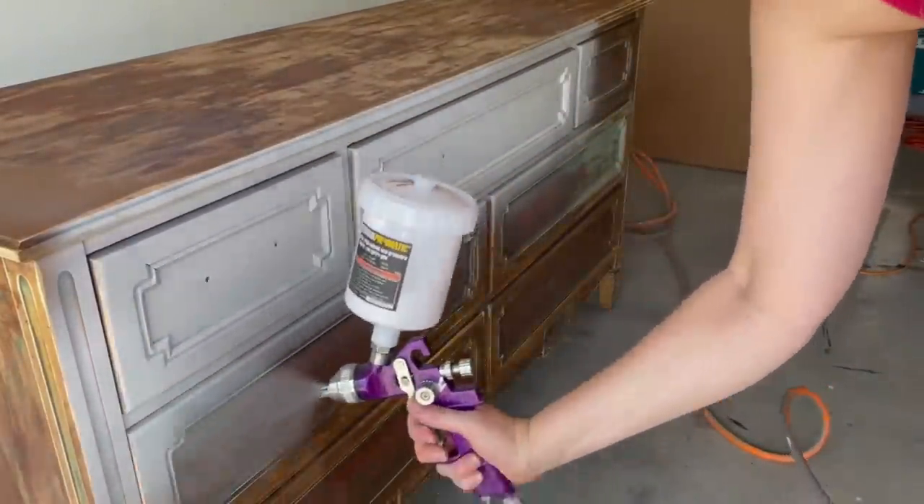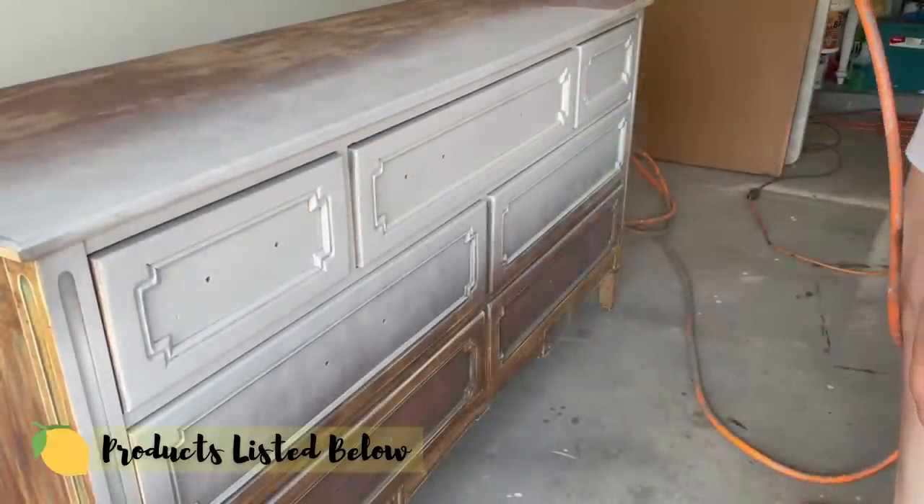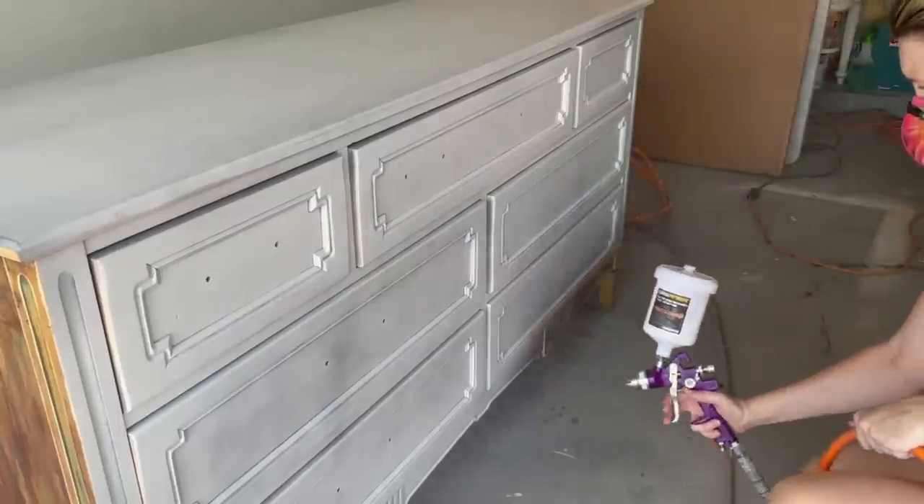I have cleaned, I have scuff sanded, and I have gotten some of the weird paint stains off. But there's still so much color and different texture on this dresser that I think the best thing for me to do right now is to take a step back. I'm going to prime this and then see what I need to repair. Normally I'd repair everything before I primed, but I can't see it all. Because of the finish I'm going to do on this, I really need to see the imperfections — so I'm going to prime first and then find all the spots I need to repair, because they should show up really loudly once I prime. All the products that I used today will be linked in the video description below, including information about my primer and spray gun.